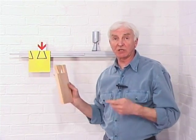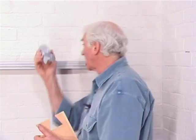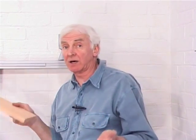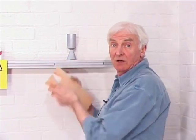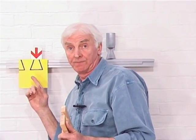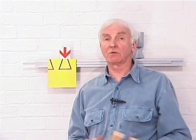That's the basis of the machine, the whole principle of it, and everything follows from that simple notion. The router is the right way up, not upside down. It tracks forwards and backwards under complete control. The workpiece, hardwood, softwood, plastic, ply, chipboard, MDF, placed at any angle under the cutter to be cut with any cutter with complete freedom. And all the time, you know exactly where you are. And although perfectly logical, it works in a way quite unlike any other woodworking machine.